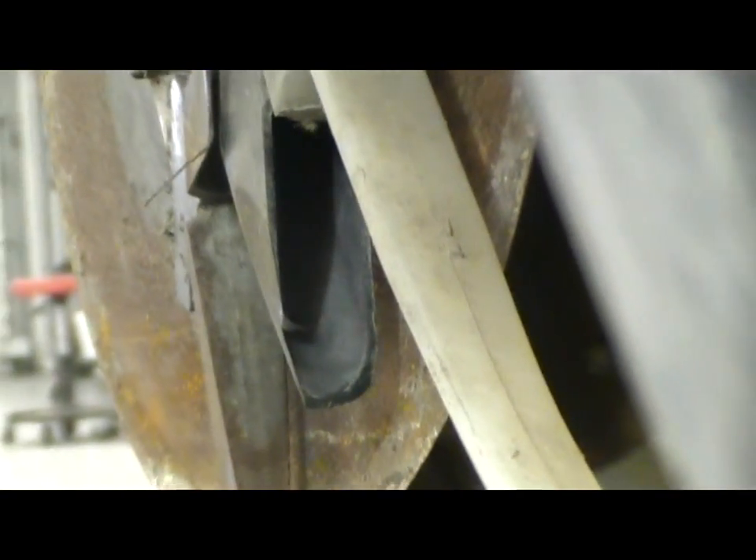What we see a lot of times causes the most problem. If you look inside — I'll flip behind it with this screwdriver — there's a small tab of plastic. As this has worn, it's actually turned the bottom of that plastic in, and this has the possibility of affecting our seed drop. It'll actually catch seeds and we'll have some spacing issues, and we could have some depth issues if it wasn't for the firmer with seed bouncing around in the seed trench itself.